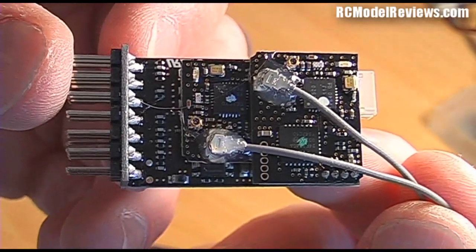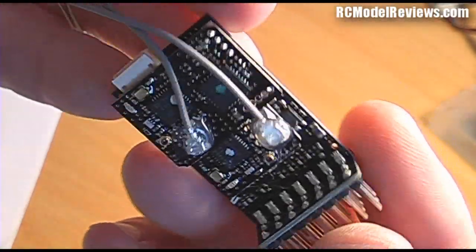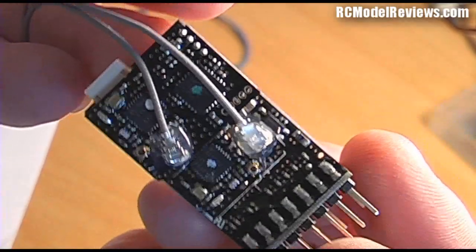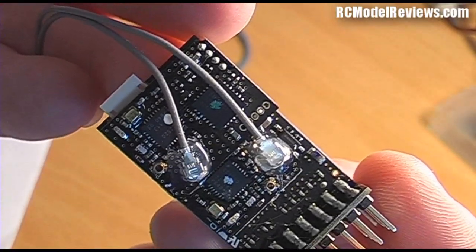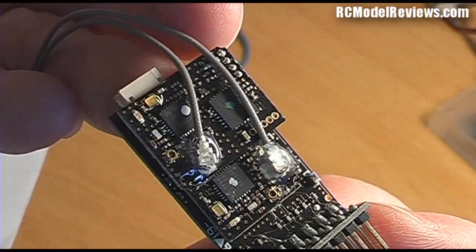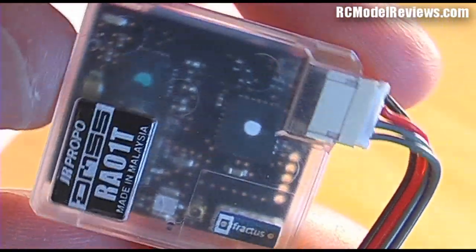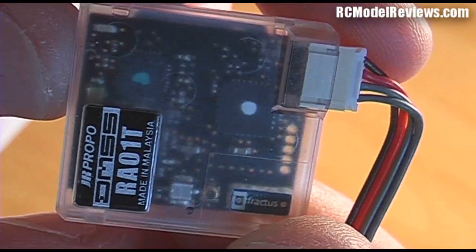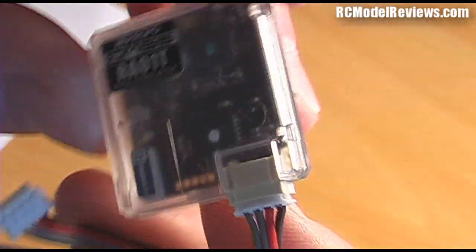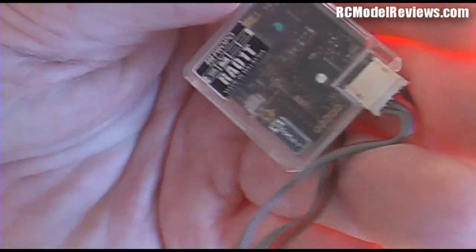It's a mixture of Microchip and Texas Instruments. The other thing I've noticed is we've got another TI chip down the bottom there - this actually has two receivers in the one unit, so it has true receiver diversity. That's very good. A lot of other systems using TI chips just have a switch and change antennas, but this has two whole receivers in the one unit. That's very good - in theory it adds up to a more robust package in terms of getting a good signal. Looking inside the telemetry satellite, I'd pick that the green chip is another PIC processor and the little white spotted chip is another TI RF processor.